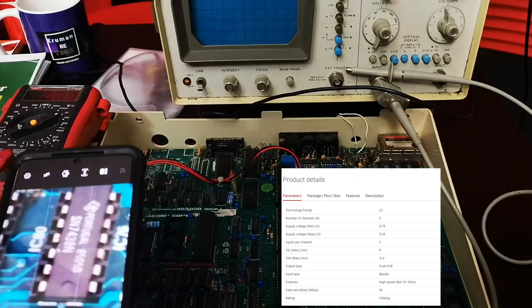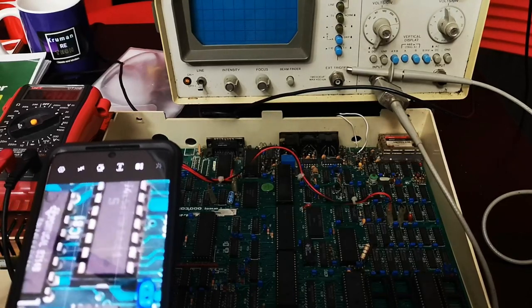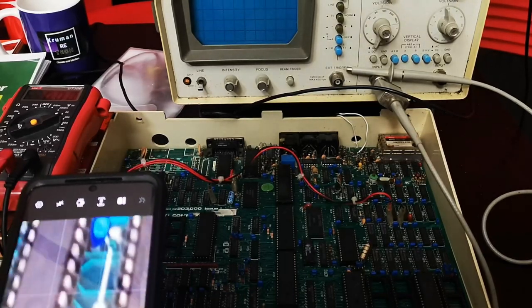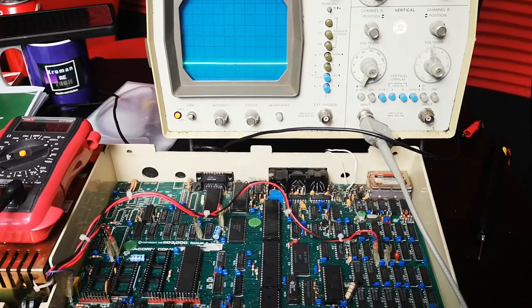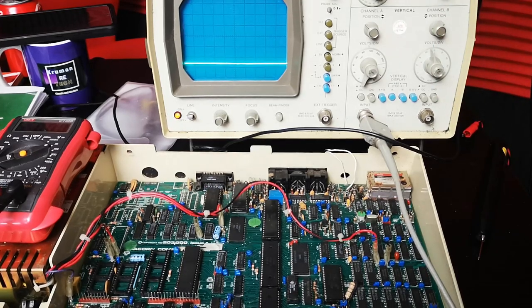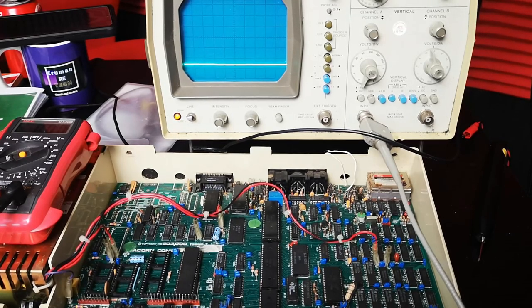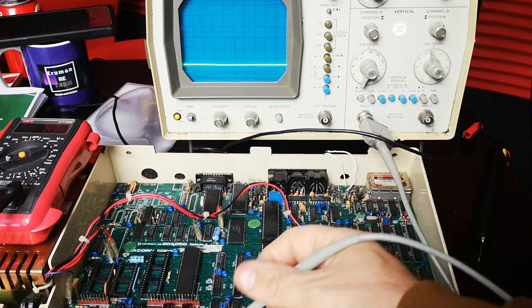You can see there's quite a number of them. When they go bad, they stop booting. So what I've done is set the oscilloscope up to give a static image so you can see it, and we're going to check out one of the first ICs on here. The strangest thing is we have a soldered-in unit, which I'm always a bit wary of.